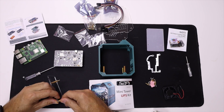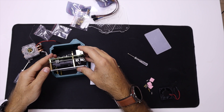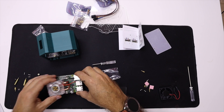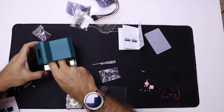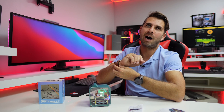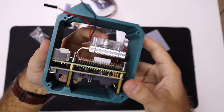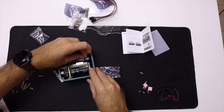When I started, I assembled the UPS unit by itself and then realized I had to remove screws because it wouldn't fit inside the case. Another mistake: I didn't place the batteries first, and then realized I couldn't insert them later. I was thinking about testing without batteries, but without them I can't display battery status information on the OLED screen.